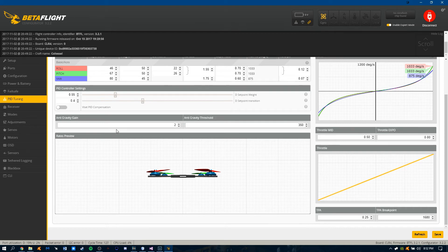You'll notice my D setpoint and transition are not stock. I think these are one of the most important things in the Betaflight PID tuning process. I would really just put them all to zero, fly, put them to 0.5, fly, and so on — and learn what they do. They really change the way the quad feels. The quad won't react drastically differently, other than the way it reacts at the end of rolls, but it will feel significantly different. And if you ever have an issue with hot motors, try messing with these because it can make quite a bit of difference.